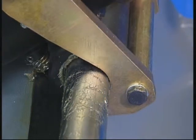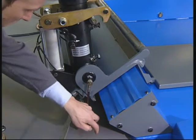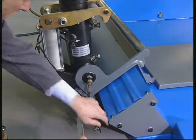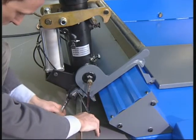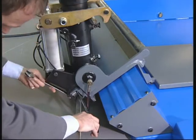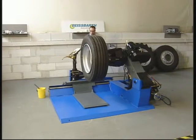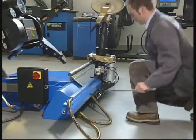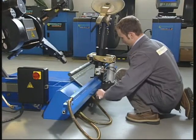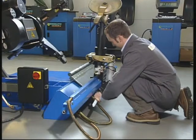Adjusting the tool arm sliding support. Adjustment is by means of the two sliding rollers. With the arm in its working position and at the end of the trolley, eliminate the play on the second roller. Position the trolley at the opposite end. With the arm in the working position, make the second adjustment. Check that the sliding support slips evenly along the entire length of the trolley.